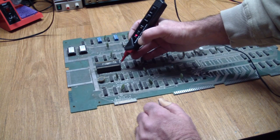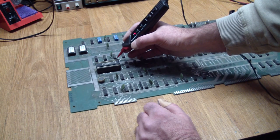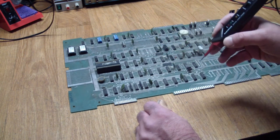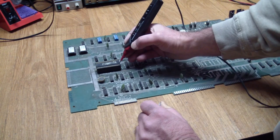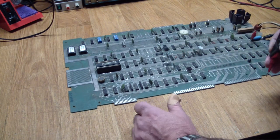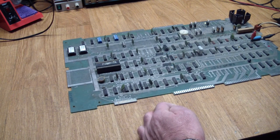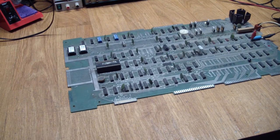Let's look at the processor. The reset line is high — that's good. Is there a clock coming in? We're looking at phase 1 over here and phase 1 is dead. The 6800 runs on a two-phase clock that's 180 degrees out of phase and it needs both clock signals. Phase 2 is running but phase 1 is dead, so the processor isn't working and that's why there is nothing happening. Let's start poking around and look at the circuitry that generates the clock.